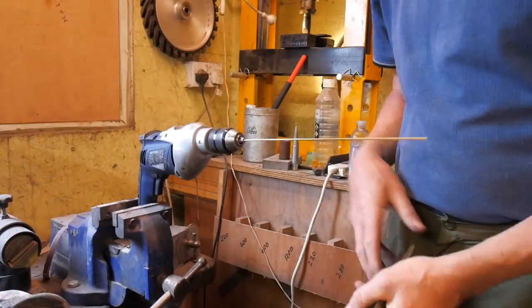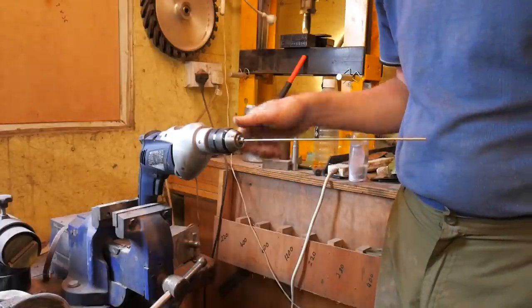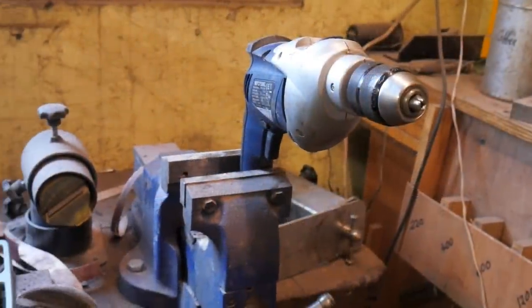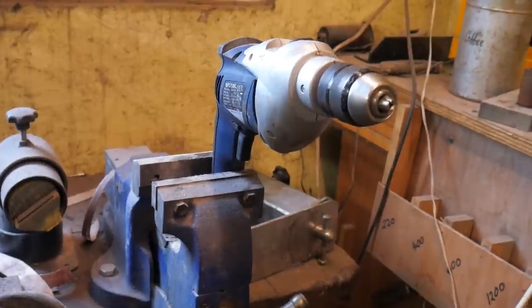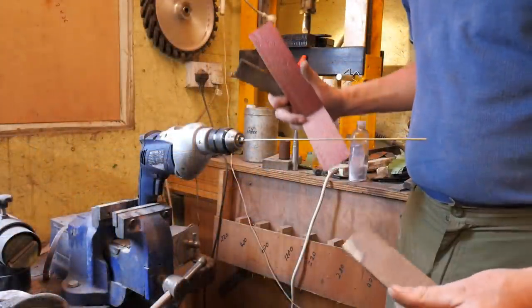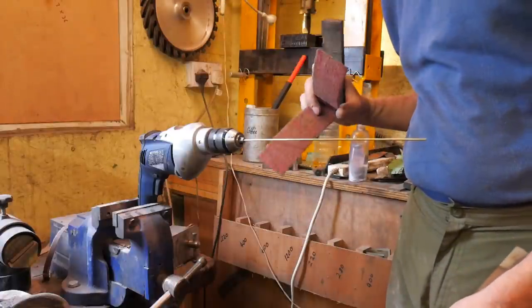Well, I've mounted my inner thin tubing into the chuck of the drill. I mounted the drill in a vise, just gently clamped so as not to damage the drill, just to hold it steady. And the best way I found to reduce the diameters is to get a piece of old worn out 36 grit abrasive belt,